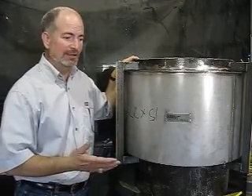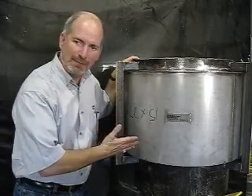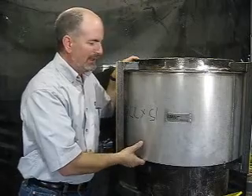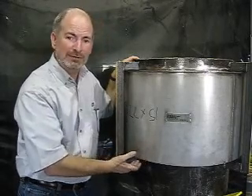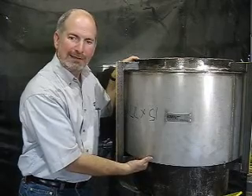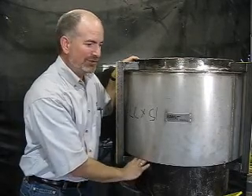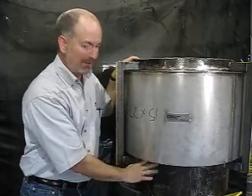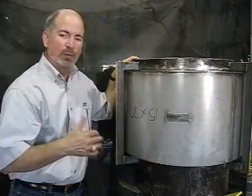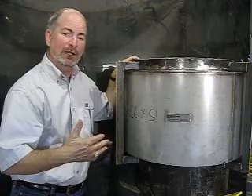The first thing you may notice is you almost can't inspect these things — they've got fixed covers, and these things aren't coming off. In fact, you may not even know that this is an expansion joint or that there's a bellows in here, were it not for this little gap. You might be able to shine a light and see some convolutions up in there. That's how you know you've got an expansion joint.